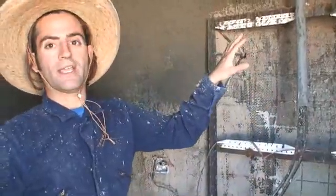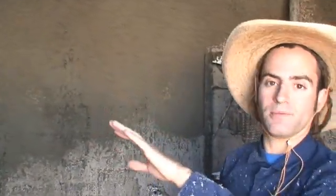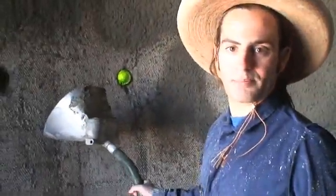This is the dome I've been spraying today with just the vertical sprayer so far — I've had about 15 minutes of spraying. You can see how much area I've covered of this 10-foot diameter dome in just 15 minutes. You can imagine how painful it would be to get up and down a ladder and hand-trowel this space while the papercrete plaster just falls off because of gravity — so this device really just pays for itself instantly.